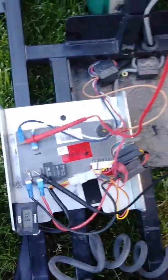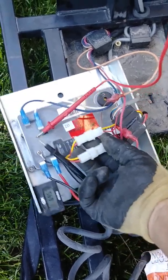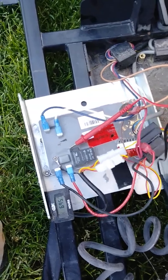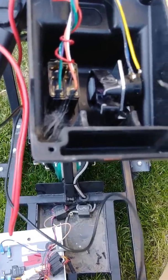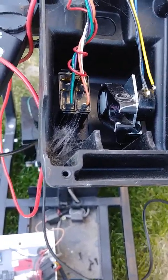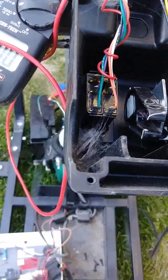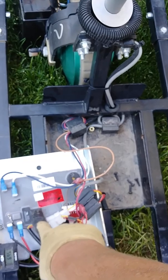Here are your little baby signal wires, and this is a relay right here. So here's the battery source coming into this system. It's red for positive — always positive — and the negative. We're getting 10 to 12 volts from the battery. But when I activated the switch, it sends these two power lines back — white and blue. White and blue wrap around here and come back into here. So when I activated those and moved the lever, which would move this, it wouldn't do anything.